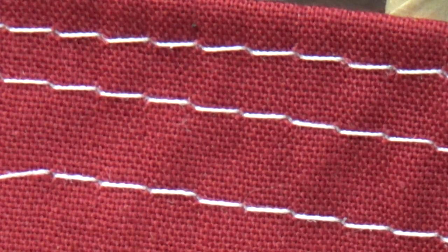Notice if you look real carefully at that top row, we still have very good stitch definition, but the alignment is just a tiny fraction of an inch, well, not even a fraction of an inch, a thousandth of an inch. It's just slightly up on the right side. Can you see that in the shot? What that is, we've taken so much away from the upper tension that it's still centering that knot, but it's not making that stitch perfectly aligned, which is a product of the tension. So that's why you back it off, you back it off, you back it off, you start to get a result on top, but you also can steal something away from the bottom.